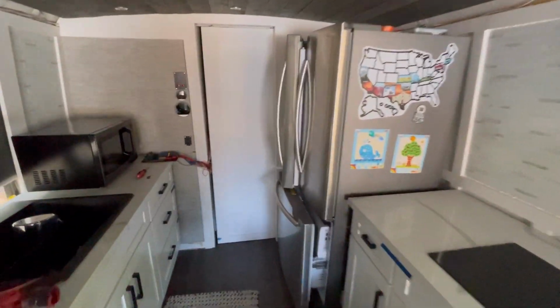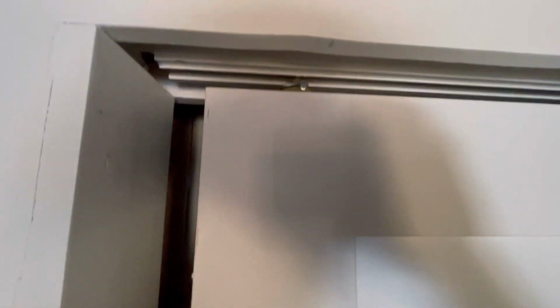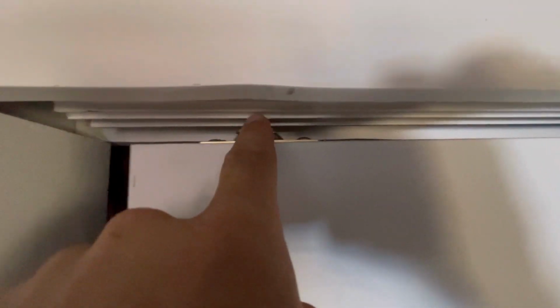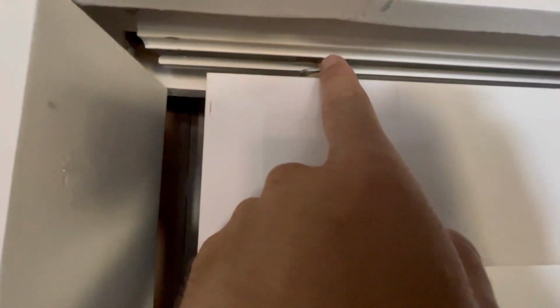All right, we got our door trimmed, and what you do is you mount these 2 little brackets up here, and then there's these posts, and you just click them into the posts on both sides. So we put ours in 3 inches from the sides. Why 3 inches? Well, because this guy right here stops at 2.5. Now we don't want to go all the way to 2.5 and bottom out and keep having this thing banging up against the stop. So we go 1/2 inch in at 3 inches, and that gives us a full close.